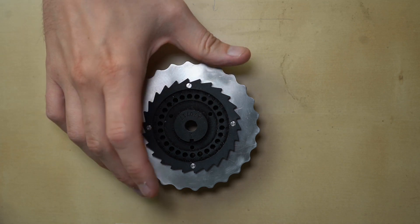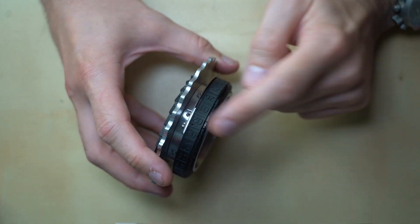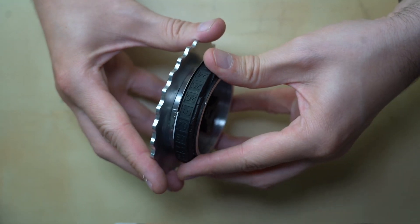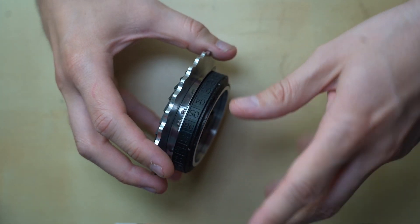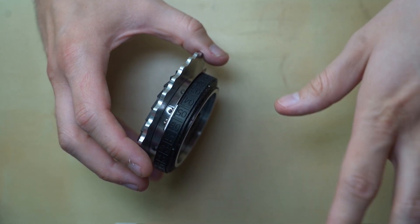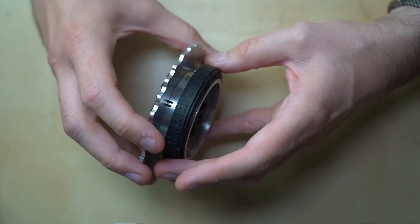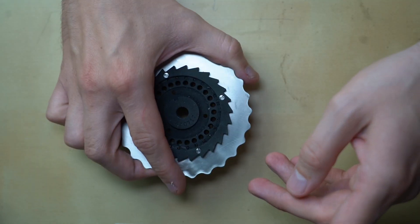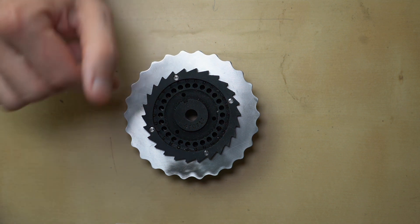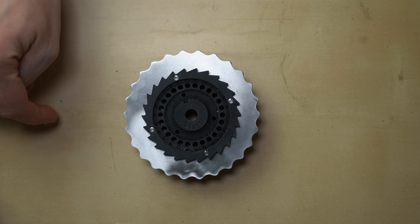Here we have our rotor so far. We have our clamp fixed over here, our clamp holder works nicely, and we have the second clamp holder over here. Both of them hold the ring in position. The digit ring still moves, so that works - it is slightly too tight, but this is probably due to the countersink holes being slightly too low. We will fix this in the next iteration. Overall it looks really nicely - our rotor is mostly done. All that's left to do are the pins, and to make our job a little bit easier with the pins we are going to do some improvements, and this will be our next video.